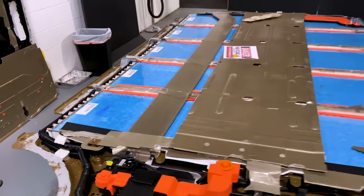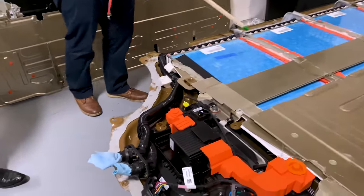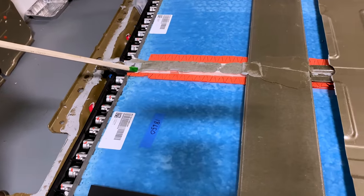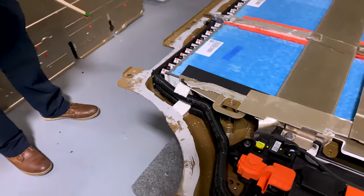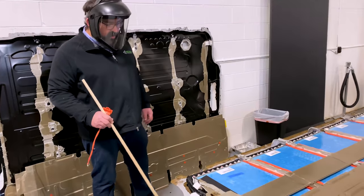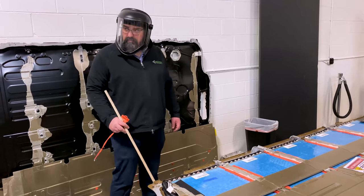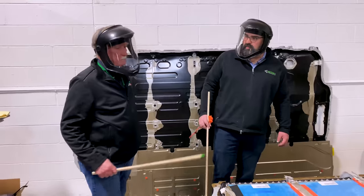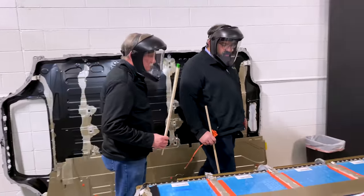This is structural adhesive that was run around the entire outside and all down these castings. You can see the mica is still actually on top of these castings — it ripped off a little bit of the mica sheet on each one. It is very rigid, very hard to get off, again making a more structural battery pack — working toward that structural battery concept.